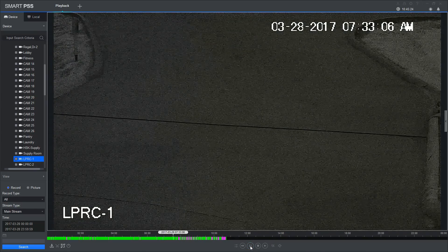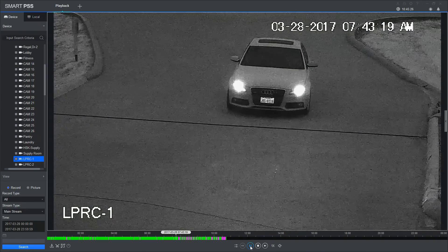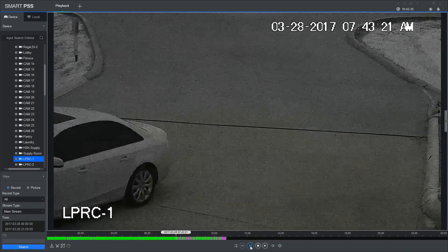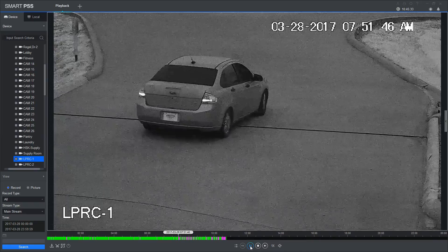The camera is able to capture about 50 feet at about 26 feet wide. So you would need an entrance about 26 feet wide — anything wider than that, you're going to need two cameras. If you want to do automatic recognition, we're trying to limit that to 12 feet wide.